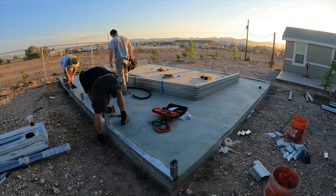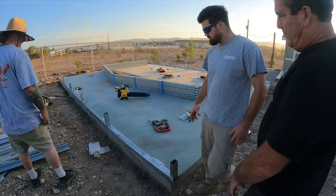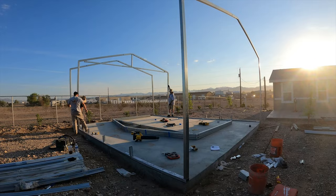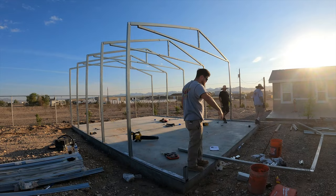Before I stand them up, I want to make sure I've got enough of these hold downs in so that when I do stand them up it doesn't fall over. At the same time, I want to leave enough that the inspector has something to look at when he gets here — that's a special inspection. Western Technology is going to do it; they're going to test the torque on them. We'll show all that and all the inspectors throughout this job process.